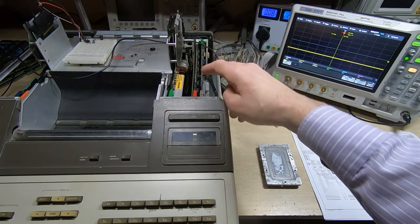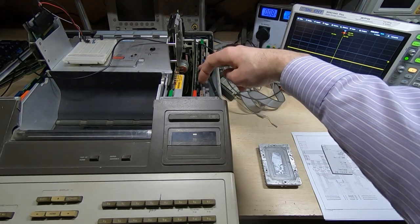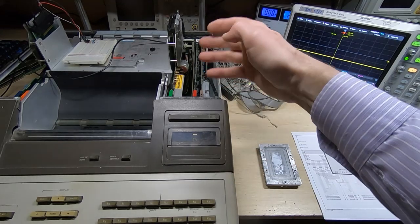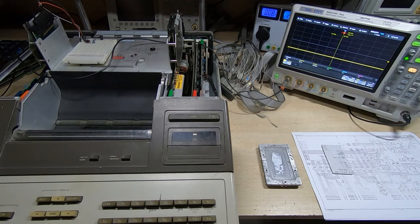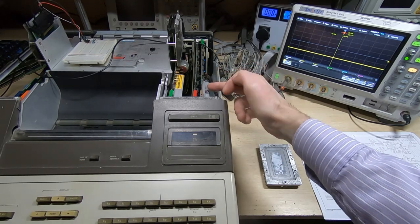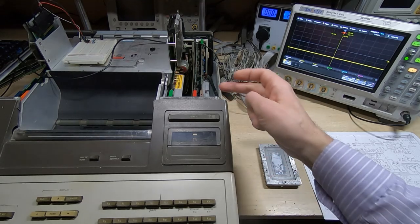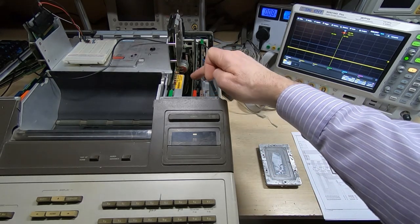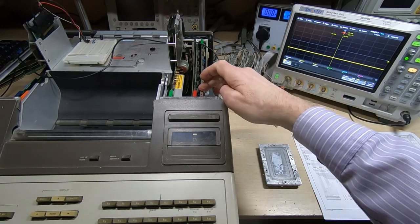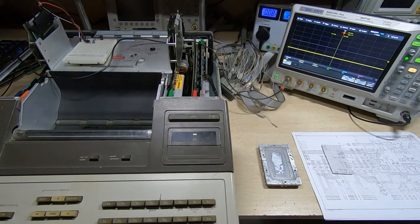What they do is look at the halt line. On the LPU, that line on the processor board is grounded, and on the PPU it's connected to the vertical drive signal from the monitor. I don't have the monitor fitted but I cobbled together a simple circuit to provide the missing signal. The LPU is going through the correct process at startup — identifying itself as the LPU and branching to the correct code. It starts by reading block 5 code, which is in the PPU RAM and ROM card.